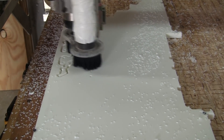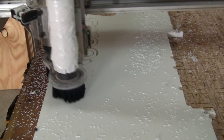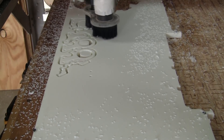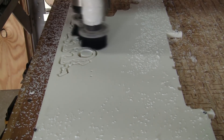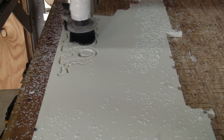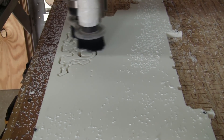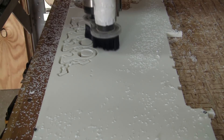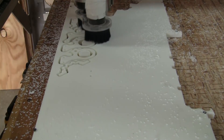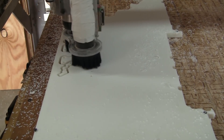There are a couple of things you probably want to take away from this: when you're doing the profiling of a large set like this, if it loses its position for any reason, you may have lost more than one part. If you do one part individually — independently of the other parts — then you can at least save a lot of the parts if something happens to the machine, like if the power goes out. That way you know you can save those individual parts. And that's a good point, because if it makes a mistake at the first or second part, you didn't ruin all your material.